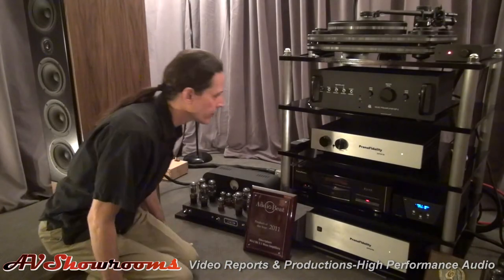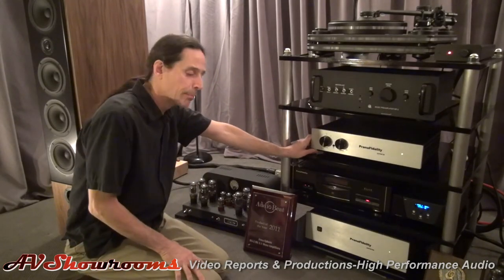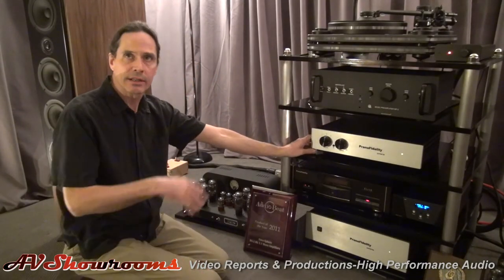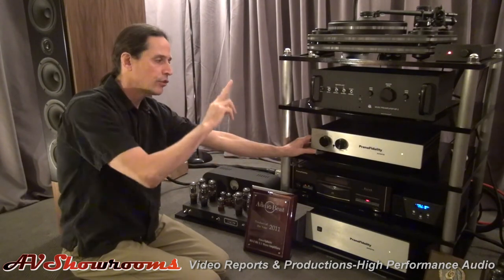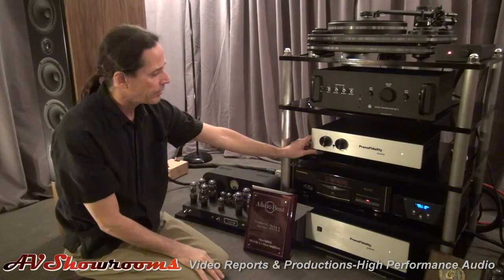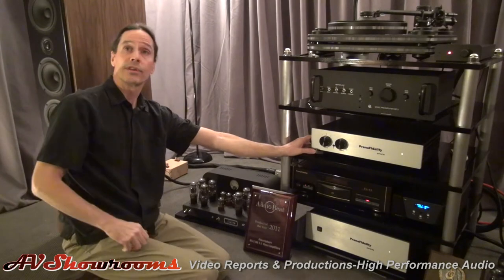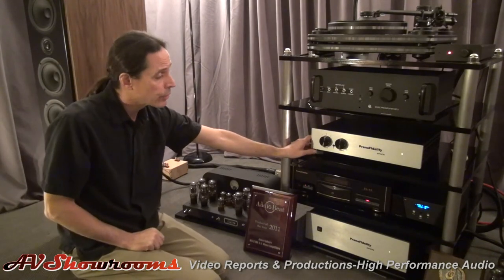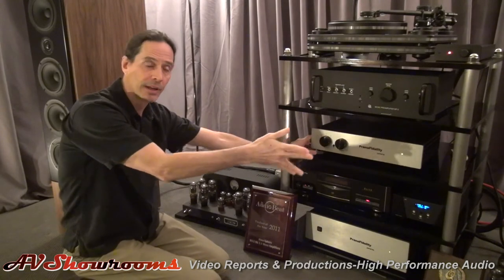Sure, you bet. So the preamplifier is a symmetrical balanced preamplifier, and like a differential, it's using input through output of two inverted and two non-inverted channels. As a result, I get to take advantage of a balanced circuit as a very low noise circuit and not have to incorporate transformers because it is discrete circuits input through output.